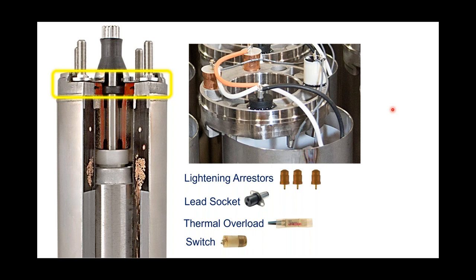There's also the two-wire switch here, and we don't want a leak path to it, so sealant goes around that as well. When you look at these two-wire switches, there is a set of contacts on the inside that make and break. That switch is used on all two-wire motors — not on a three-wire motor — and that making and breaking of those contacts is what allows the motor to go from the start windings into the run windings. All these components are built into the top end bell, which then gets flipped upside down, and a laser weld holds everything in place.